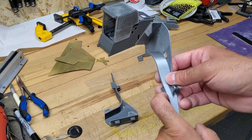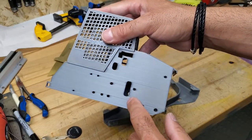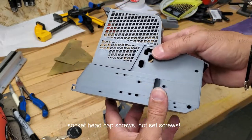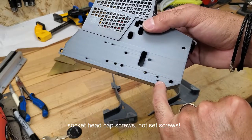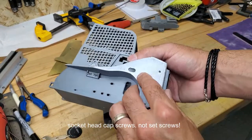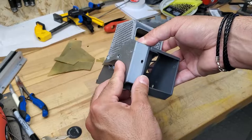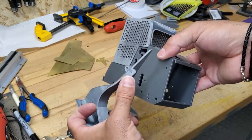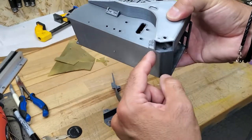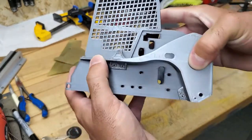This takes 2mm screws and 2mm set screws, about 10 or 8mm long, going through with a lock nut on the other side. Keep in mind: before you assemble everything, you're gonna want to put the motors in last — so anything in the way, like these two set screws for the tracks, put those in first. Another tip: super glue everything here if you're not looking to take it apart, put it in place, put the screws in — that way you'll have extra strength.